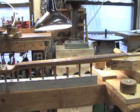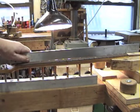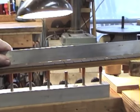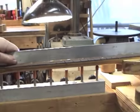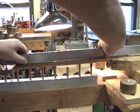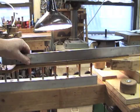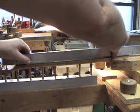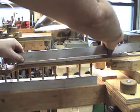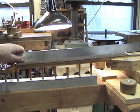Now I've sanded the fingerboard and I'm going to check the arc of the fingerboard. I've put a light behind it and I'm going to use a straight edge in three places — right down the middle, on the high E, and on the low E. If you look very carefully, you can see a gap — see the light under there? You've got to make sure the gap at the seventh fret is the same for all three positions. This one is actually pretty good, so we're going to leave it and do any correction with the frets. The fingerboard is all prepped — sanded at 320, then 600 on a hard block, and filled in all the chips with super glue.